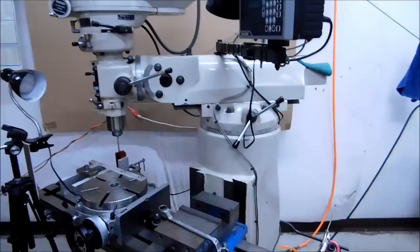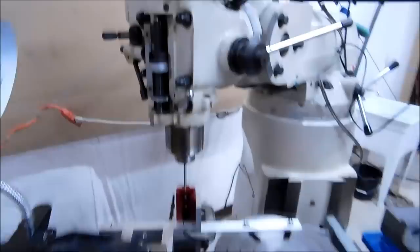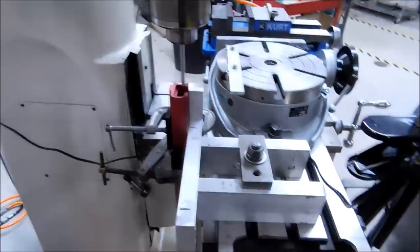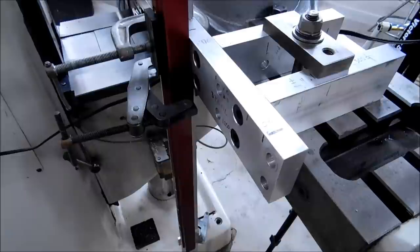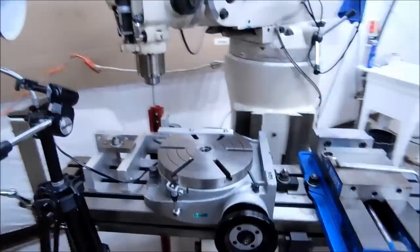If you have any questions about any of the other controls, nuts, or levers on this machine, put it in the comment line below. It may look intimidating but if you know each and every one of these, it's really not a big deal. Very versatile machine — a good addition to the shop. If you don't have one of these long outriggers, sooner or later you're going to make one. This machine is usually set up with two Kurt vices, and this particular configuration is meant to be squeezed in the Kurt vise and then bolted through the back — a really quick thing to set up. This can be used in this format or 90 degrees. Hope that helped, thanks for watching.